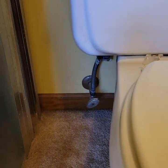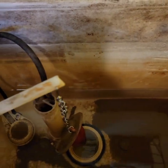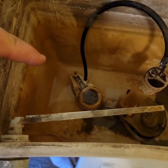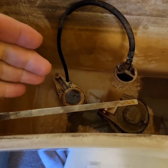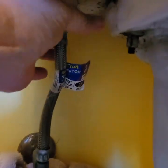Got to turn this off. You've got to clear the bowl because the back of it will hold water and then drain back down the pipe. We're going to put a bunch of towels down here too. We flush the tank, and what happens is when you loosen the nut that holds the supply line on, your water fill is disconnected and that's what leaks. So we are going to unscrew this — this is where the water comes out.